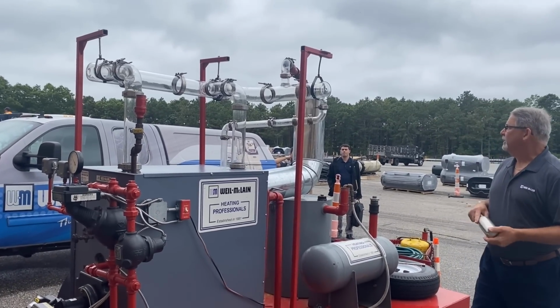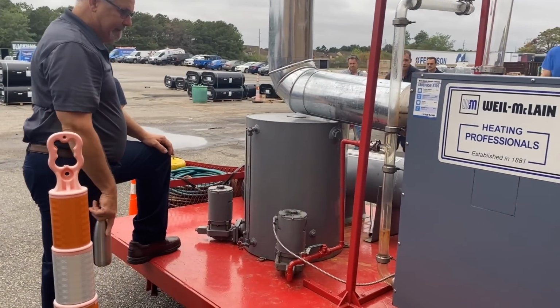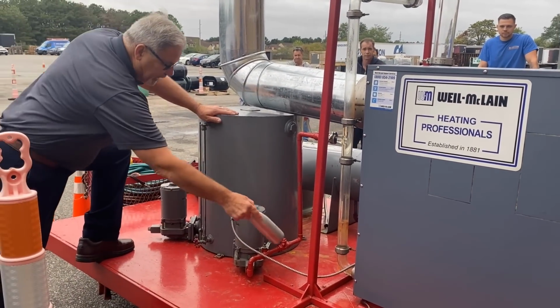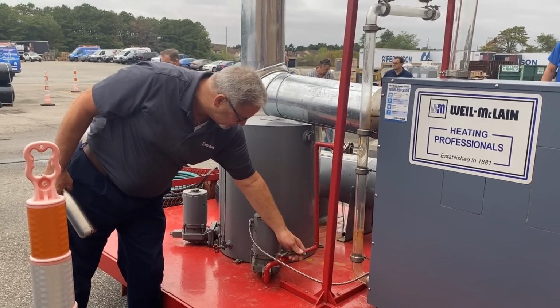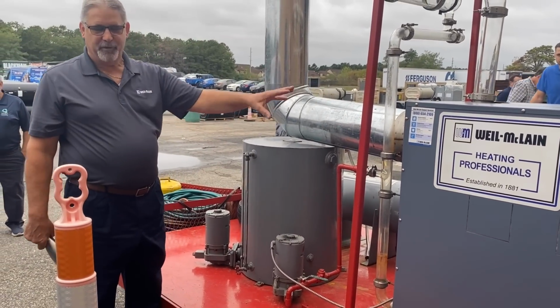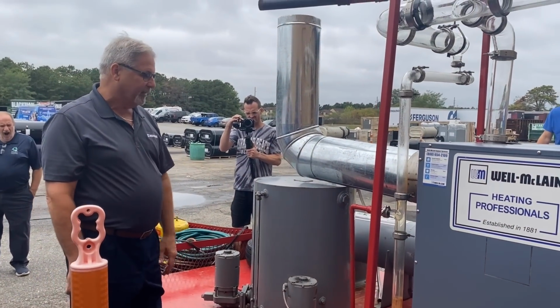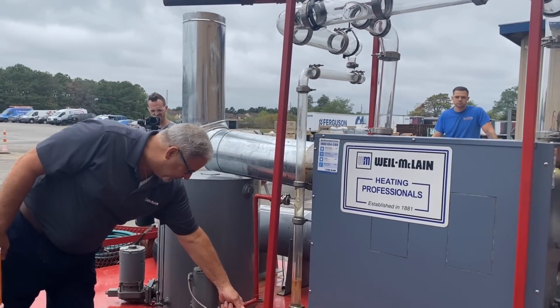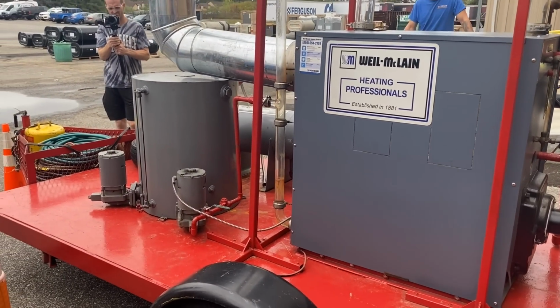What else can I tell you about it? I have a check valve. I got a shut-off valve, which I'm actually going to crank down because when it feeds, when it's really hot and steaming, my feed is causing some water hammer pretty violently. So I'm going to let it feed really slow. I'm cranking that down.